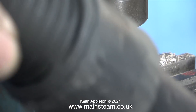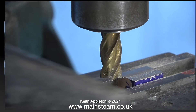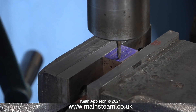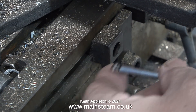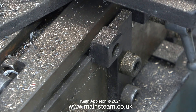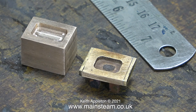When using a milling machine or a drilling machine it's really important to keep the machine vice clean. The job is going to get a lot more precise and I don't want any chippings giving me a false position when I clamp the part in the machine vice. I'm adjusting the longitudinal travel limiters, which are just two blocks that can be clamped to the table each side of a central stop point, and in no time at all using a one-eighth of an inch diameter cutter I have the cutout for the slide valve.